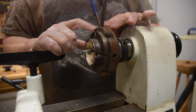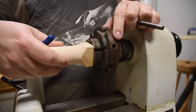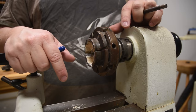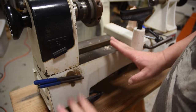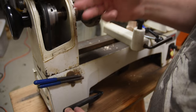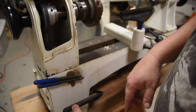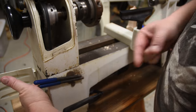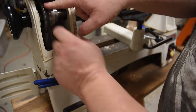When you get the chuck, because you're on a mini lathe, I'd suggest getting what they call number three jaws — they're kind of the standard jaws. You can hold spindles with them and they're big enough to work with most bowl sizes you'll use on a mini lathe. Most mini lathes are going to be a three-quarter horsepower motor, some going up to a horsepower, but that's more than enough because we have the advantage of gears. Most have three gears — where a lot of larger lathes only have one or two and depend on other things to change speed.